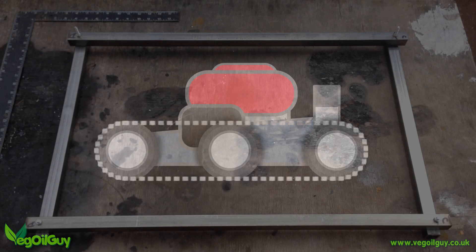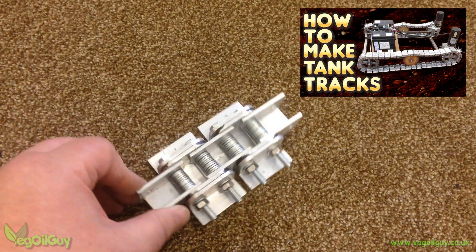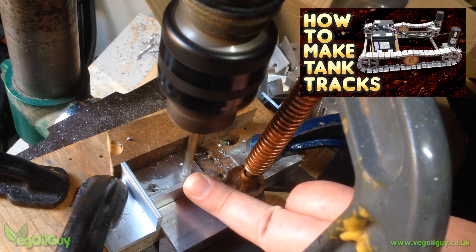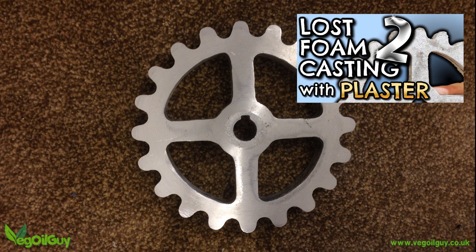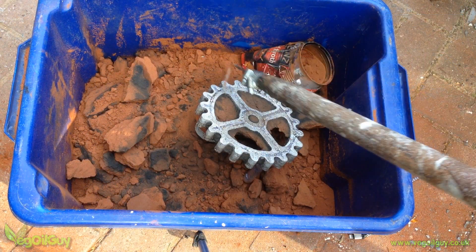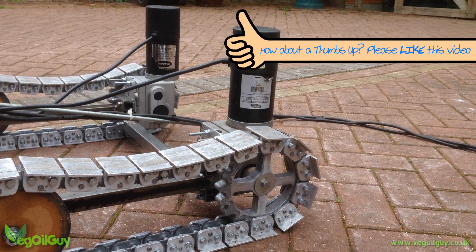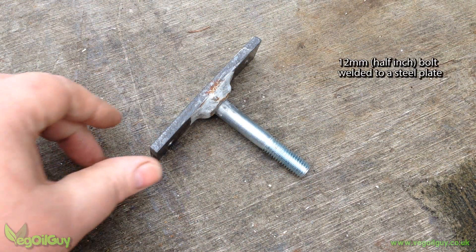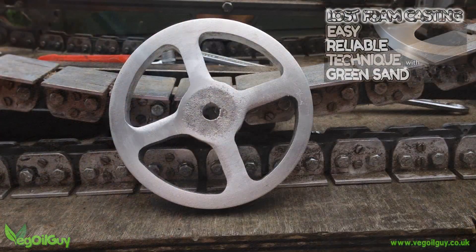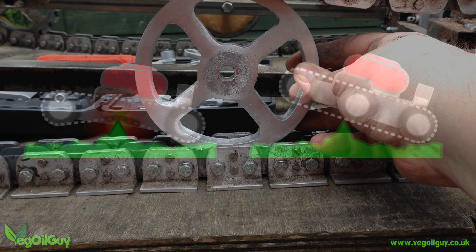This meant I needed a little extra room, so I built a simple frame from 1 inch box steel, just a little bit bigger all around than the mower. I designed my caterpillar tracks from scratch, coming up with a fairly simple design that could be manufactured with the most basic of tools, and yet still give me all the articulation I was looking for. These tracks had to be driven by a sprocket connected to each motor, and these I cast myself using my lost foam casting technique. The motors were bolted to the rear of the frame, and the sprockets were bolted to the motors. But I still needed to connect sprockets to the front of the frame. At that time I came up with this simple T-fixing, and it was a mistake I'll talk about later on. These were simply bolted to the frame. I also cast some support wheels — these help carry the weight of the tracks and prevent any undue strain on individual links, especially on rough terrain.